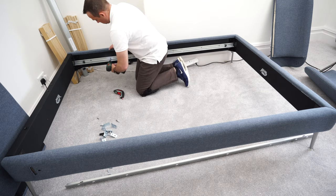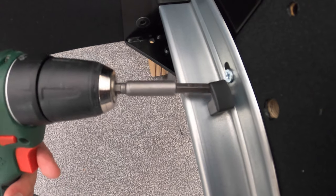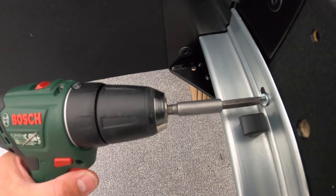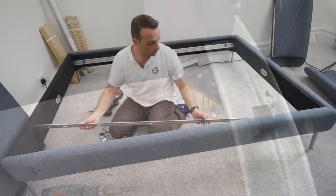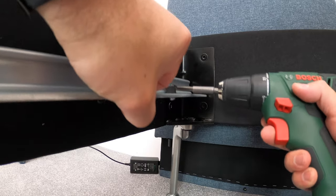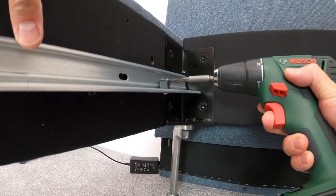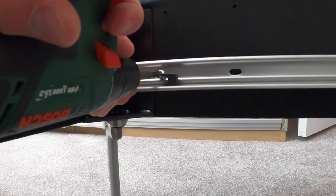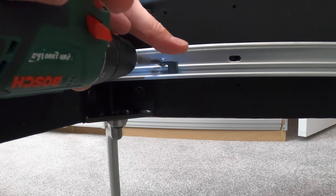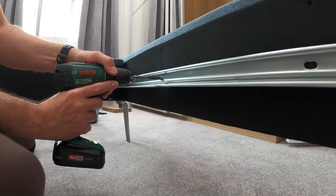Sometimes it's quite hard to get into these screws, but you can just twist the stopper on the side while fixing the screw — once you're done you can just twist it back. On the other side, exactly the same L-shaped bracket in the second hole. As we have everything positioned on the second hole — both L-shaped rails on the side and the brackets for the mid beam on the top and bottom — just secure this L-shaped bracket with all screws for those holes.